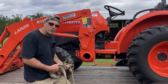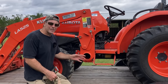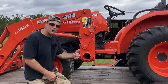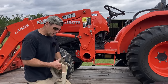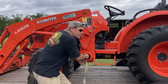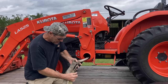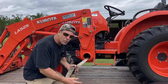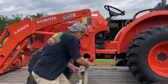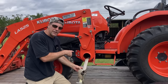For over a dozen years that I've owned Kubota L-Series I've had to trailer them from where I keep them stored to where I use them. The way I've attached it is I would get these straps with these hooks and I would go in this cavity right here where the loader's mounted and hook it there, then take the other hook and hook either to a stake pocket or the frame somewhere, tighten this strap up, and take a piece of the strap and put it under there so that it doesn't cut on that sharp edge, then tighten it up and do the same thing on the other side.